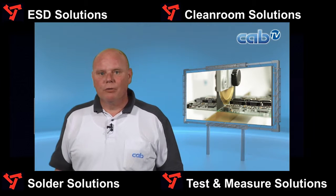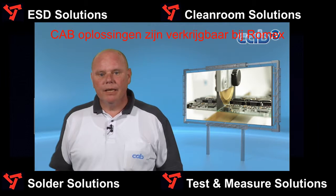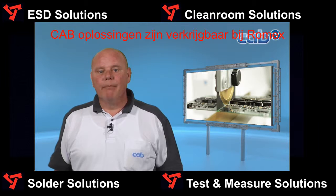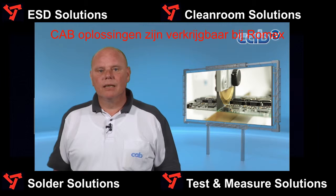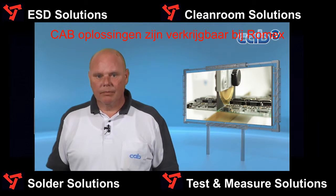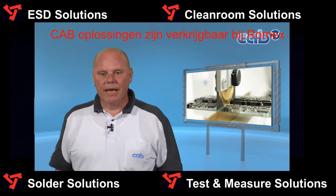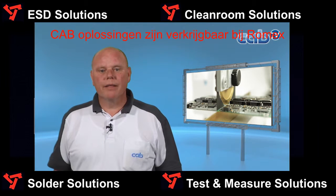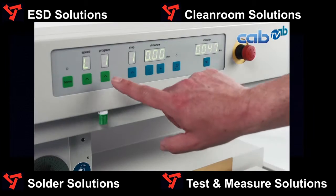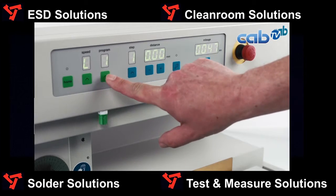Furthermore, Maestro 4S offers the possibility of separating PCB with not just one, but several cuts. The main advantage of separating components with several cuts is the reduction of tensile and compression strength. In other words, the less material is displaced per cut, the lower the stress on the component. Please see the separation process with three cuts.